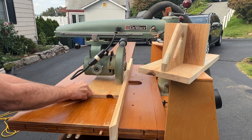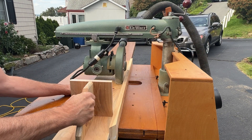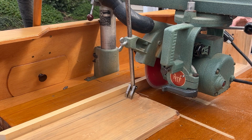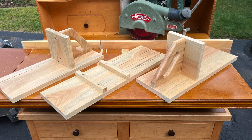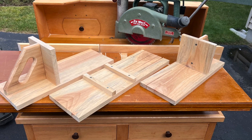Once there's adequate room on the table, place the push board directly behind the workpiece. Finish the cut keeping the push board flat and against the fence. Push until you reach the stop, then retrieve the push board by pulling it straight back. Push boards are easy to make, easy to use, and an effective way to safely feed a board through and past the blade.